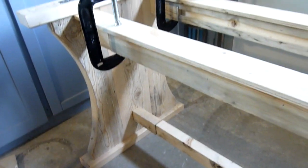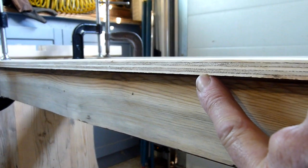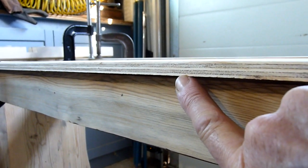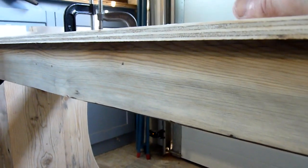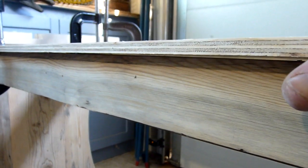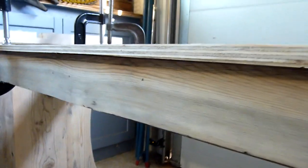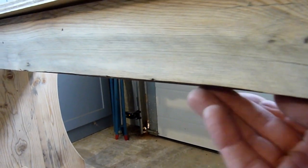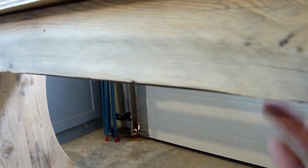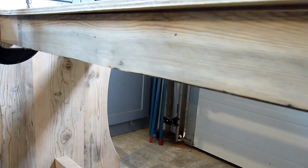So, progress thus far. I'm taking this 1/2-inch plywood and I'm going to put that on the top because of the dimensions of the boards I've got, which are offcuts. This is going to be 3/4 inch fir on the outside edges. This will not be visible from outside unless you really get down on your knees. So I'm going to use that on top, build the box, 3/4 inch fir. I'll probably have another 1/2-inch piece underneath, and then a 1/2-inch piece on the inside where it's not visible either.